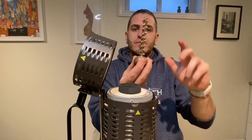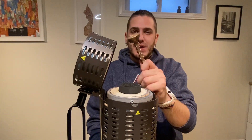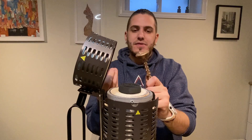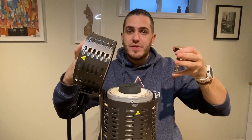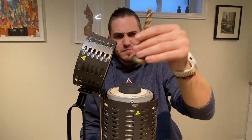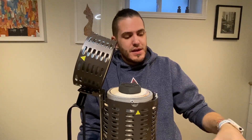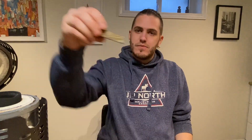Referring to recycled metal, this is a big chunk of bronze from a previous cast that had a whole pile of rings on it. As you can see by the button, it's a little bit big — you do want a nice button when you cast because it pushes metal down by gravity while also getting vacuumed from the sides. However, this doesn't fit in my melter. If I had the three kilo version, this would be no problem. New metal comes in ingot form, and the end cap of one won't fit in this melter at all. I run it through a steel bandsaw and cut the 20-pound ingot into chunks that do fit.